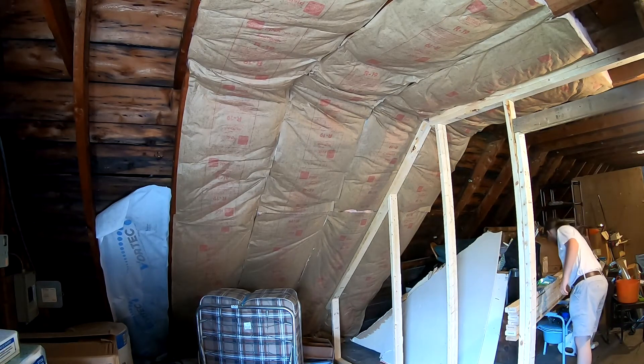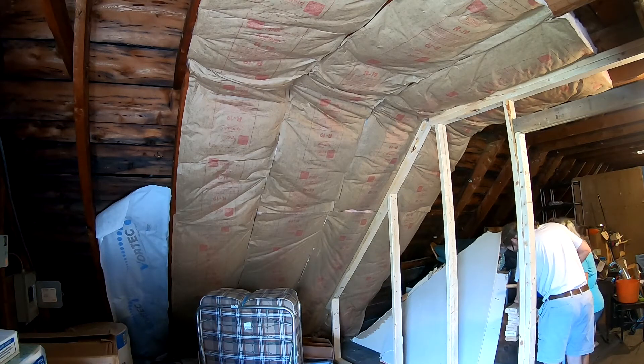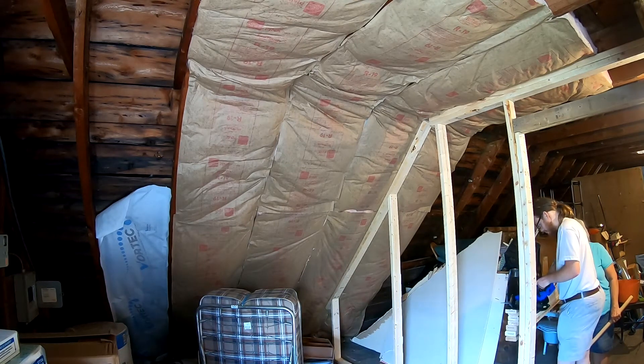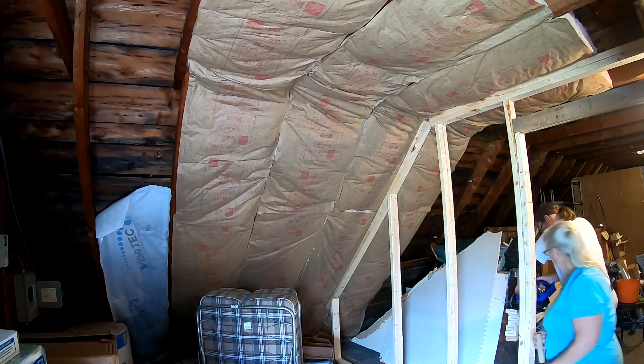It's scary to cut this for a 45. You're not on a 45. Which end of this board is the end you're using? I was thinking this end here — that's 45 here. And then you measure from the long point of the 45. Are you putting this here to keep it or not? Yeah, there.